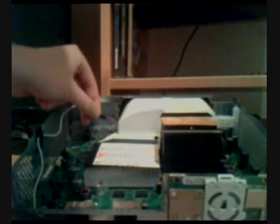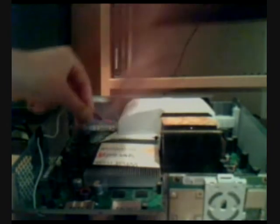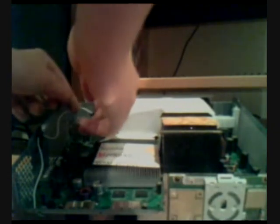If you're going to do it to both, you cut both the red and brown wires, strip them. If you're only going to do it to one, find the corresponding wire and cut that one. I only did it to one, because when you cut both of them and do both, it can be very loud from what I've read, and also because only one was broken, so forget the other one.